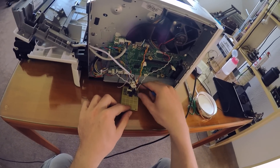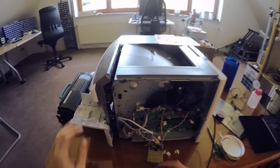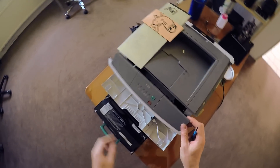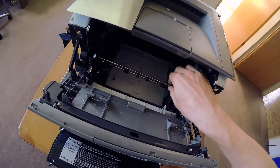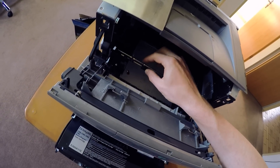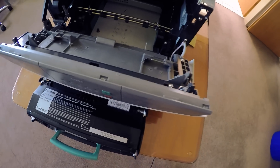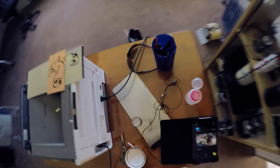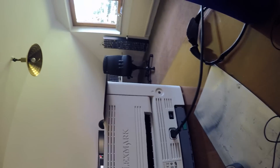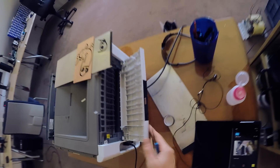The original assembler program is available on the Instructables page, and I also made an AVR-C program for ATmega 328 microcontrollers because that was what I had available at the time. This is the new manual infeed mechanism, which is basically a spring-loaded shaft with rollers. The original Instructables called for aluminum rollers which are not available in Germany, so I used ball bearings. Overall a very satisfying project — I can highly recommend it, especially if you are into fine-pitched single-sided boards.